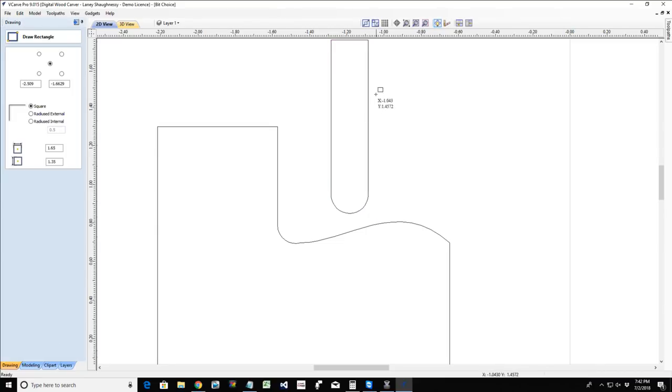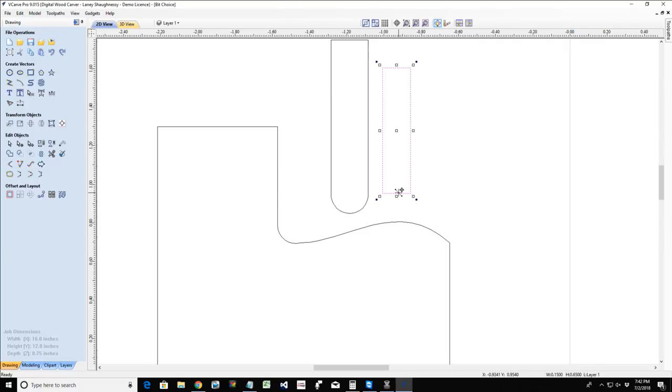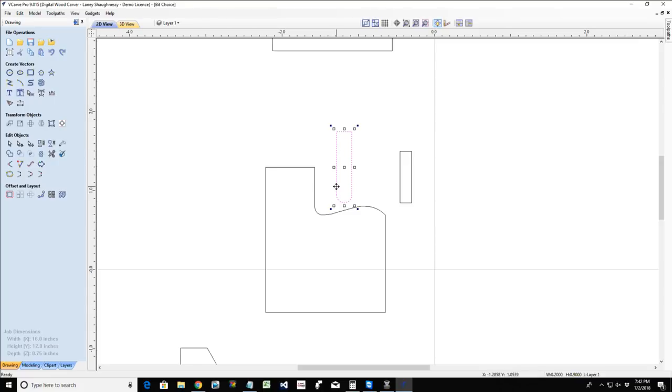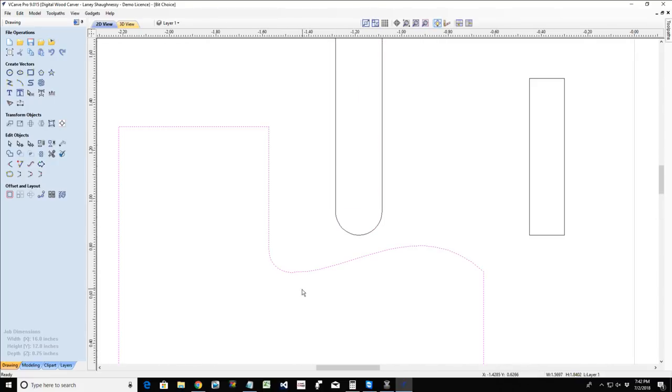That's because we generally have a straight end mill doing what's called a 3D rough cut. That straight end mill comes in and hogs away all this waste material, leaving a small amount of material right above our model. Then our ball nose bit comes and removes the rest of that material down to our finished cut depth, working off the tip of the bit. As we get deeper and deeper into those cuts, we end up with that straight wall, and sometimes we get tool marks on those lips.